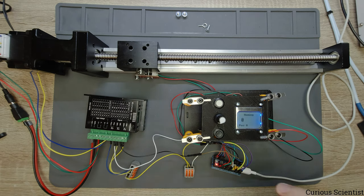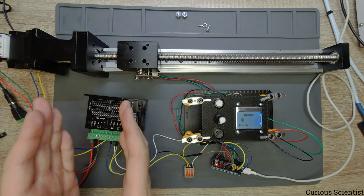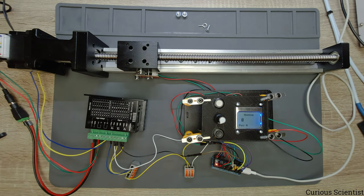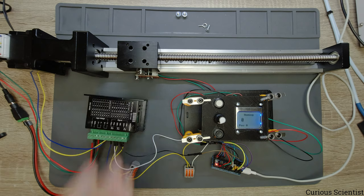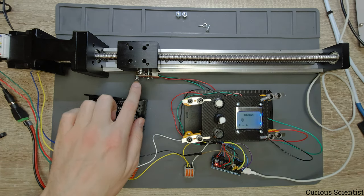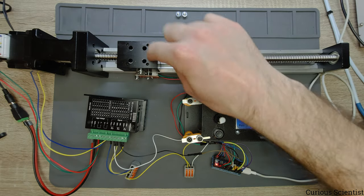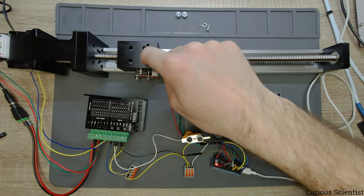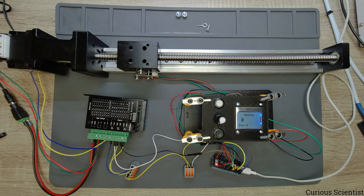And then the microcontroller will zero out the position there. So when this moves back to the limit switch and then moves a bit forward to switch off the limit switch, that will be our zero position. So this has to be mechanically defined. So you basically define it by positioning your limit switch. But once it's done, you have a, let's say, global zero position or origin for your carriage, which means that wherever you move, you will perfectly know the location, because you define the zero position.